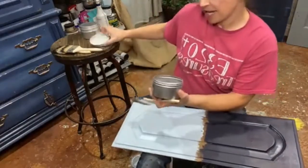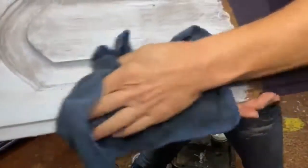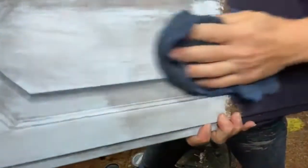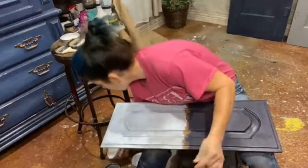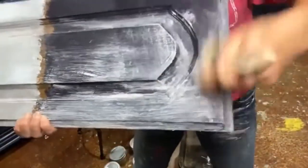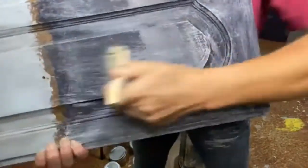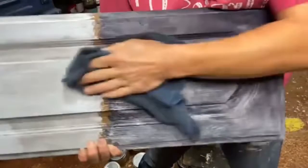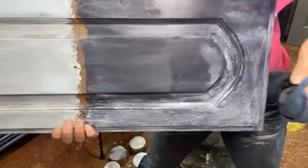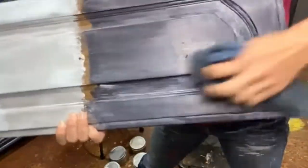Grunge Gray is a really nice medium shade gray. See how that chalk paint is soaking in the wax. Now I'm dipping my white brush in white wax. The longer you let it sit, the more it's going to soak into the chalk paint — if you're looking for a super grungy look, just leave it sitting on there and it will soak in. If you have a clear coat on it, it'll still wipe off that clear-coated chalk paint. See how it's wiping back — I missed a spot here with the clear coat and that chalk paint is just soaking in the wax.